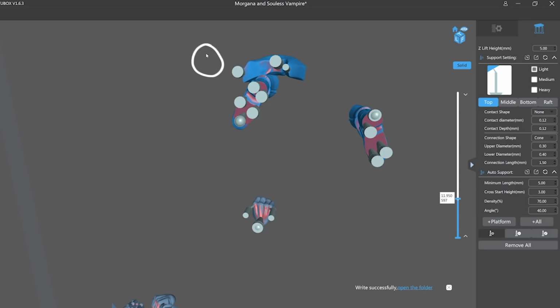Portions of your resin 3D print will start to cure before they're attached to the main body of what already is supported, and in that event there'll just be little resin bits floating in your vat until your resin printer gets to a layer that connects the floating island to the main body of what's being printed. And by then you've already lost a piece of your mini, and having a chunk of cured resin floating around in your vat is likely going to mess with future prints.